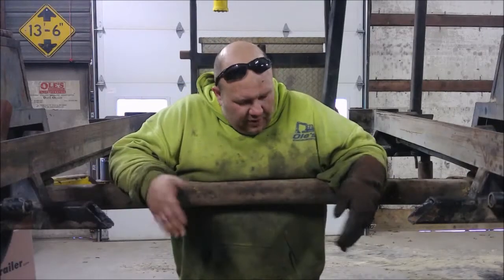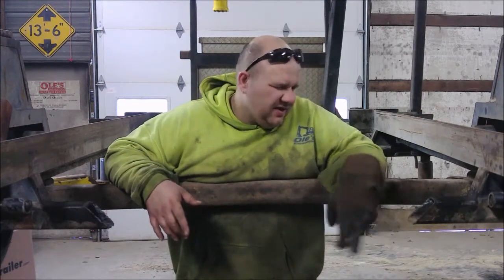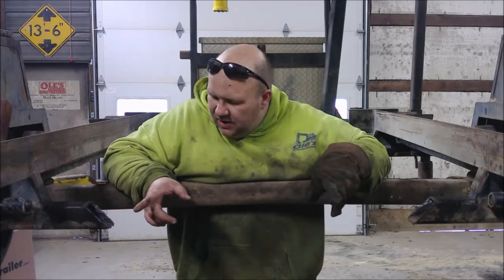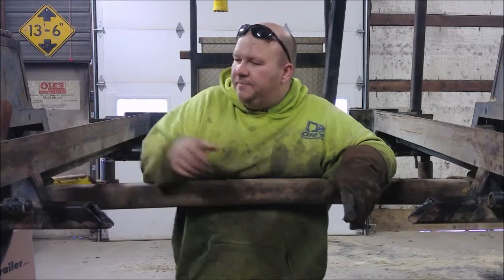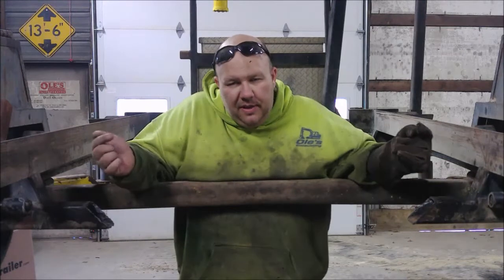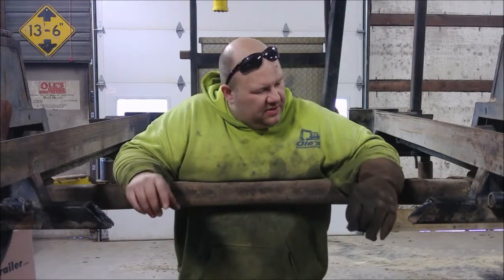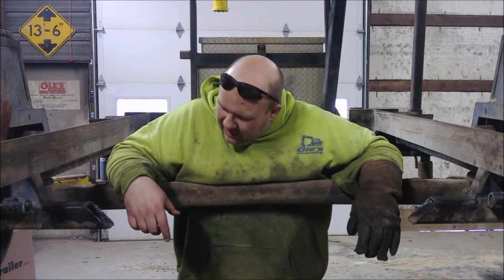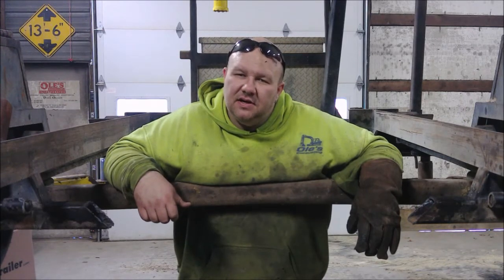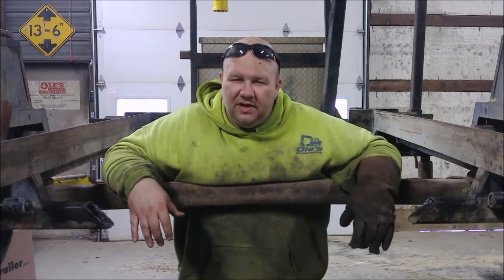There we have it. We got the Wolf 45 off here. We'll get it all blown out inside — there's a good bit of dirt and stuff sitting in here, so it's probably taking away some of the integrity. We'll take the grinder to clean up all the slag and rust. We've got an insert we're going to try and get slid in here. If I need to, I'll just take the wheels off and be able to get this pipe put into place. I'll be able to slam the inserts in from the ends for extra reinforcement. This stuff looks like maybe eighth inch tubing at most, and we've got some three-sixteenths or quarter inch — thicker stuff — so that will be extra stout with a little extra meat to work on.